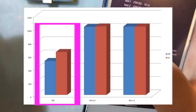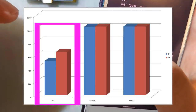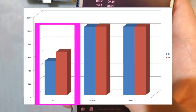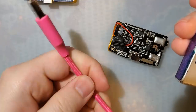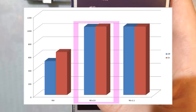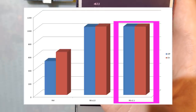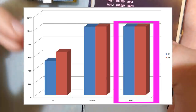USB 2.0 introduced a 500 milliamp power supply per USB port. So, as long as your device is compliant, you plug your USB-A to USB-C cable in, it'll charge just fine. The RetroSix one, on the other hand, charges at 1 amp, or 1,028 milliamps. Didn't really change once I added on the module. Yes, I'm showing 5 milliamps higher, but I would call that margin of error there. 1 amp charging,